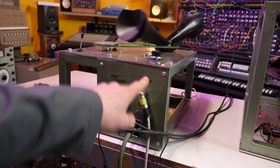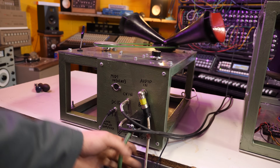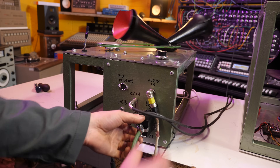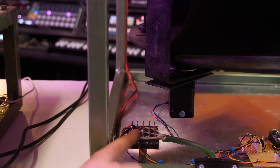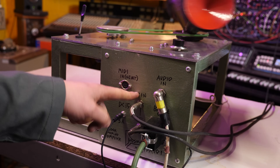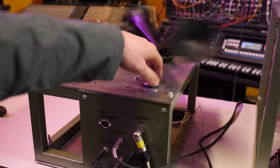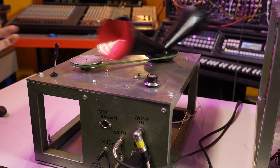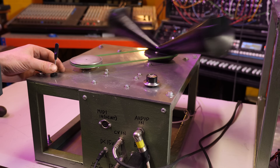Anyway, we've got the audio going in - that connects to the crossover that's in here, and then the crossover takes the high-end audio and sends it out of this cone, and then the low end goes through this multi-core connector - this Jones plug right here - and it travels over to the other speaker via this multi-point connector right here. This multi-core cable also has the MIDI going over to this, the control voltage going over to this, and also the power for it all. MIDI in channel 1 is actually modulation now, and we've also got separate control voltage in for this one and control voltage in for the other one. There is also a zero knob on the top. And then we've also got a direction switch - this is connected straight to the stepper motor driver direction pin so you could just flick it left and right, though direction doesn't really make a difference.